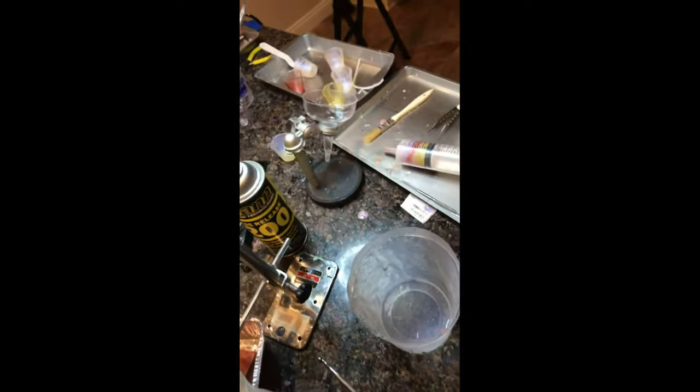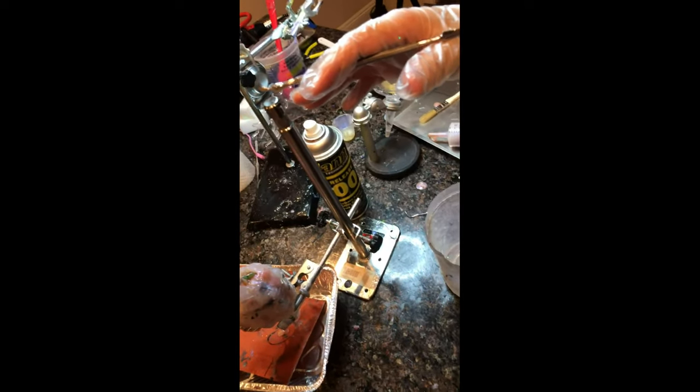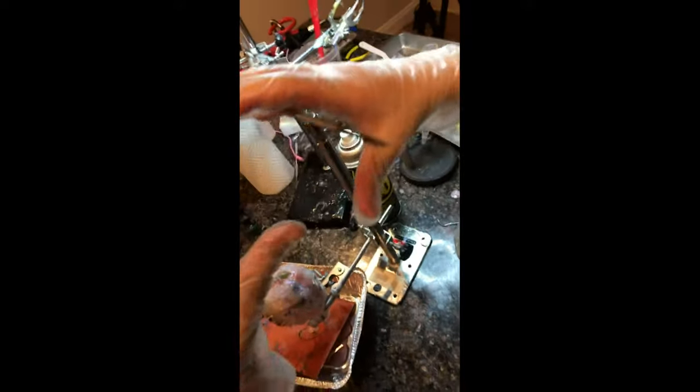When we lay up composite materials, you do it with all the direction of the fibers in the direction of strength and stress pattern, stress transfer, whatever. So the Medusas that I have designed have all been designed to be maximally stiff in the direction they need so that they don't buckle lengthwise while you're inserting them. They stay stiff while you insert it, but it can squish.